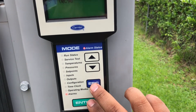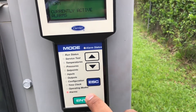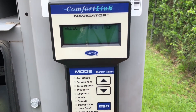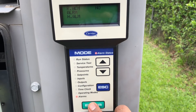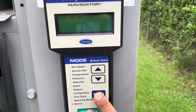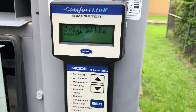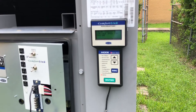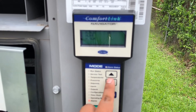You can see the same alarm — BO.98 and variable speed fan failure — because I have that motor disconnected. But it's no longer affecting the rest of my motors because it is disconnected.